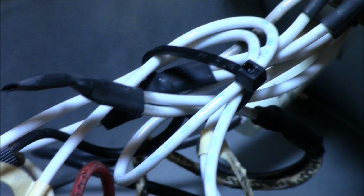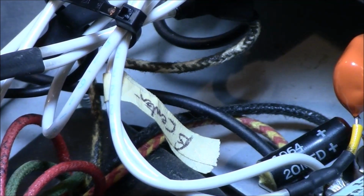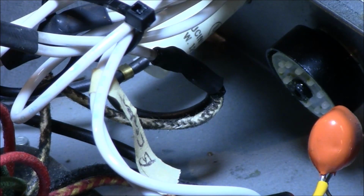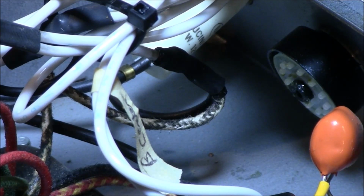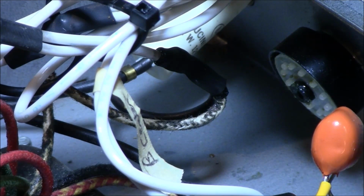All these old amps, a lot of people save them and say, hey look, see, I did do a refit on this, recap, retube. I'm very curious to know what kind of shape these parts are in, especially the brown ones. Like I said, those are originals, very old, 50 plus years, and very prone to fail, especially at this late date.